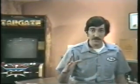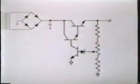There are some high-voltage power supplies in games that also have to be regulated. For instance, the Bally/Stern pinball machines have score displays that require about 190 volts to operate, and that 190 volts has to be regulated — it can't fluctuate very much. We can't use the 723 to regulate a high voltage, as the LM723 is strictly a low-voltage regulator IC. When we want to regulate a high-voltage power supply, we have to make the supply out of discrete individual transistors, resistors, and diodes. This circuit is typical of those found in pinball machines and monitor power supplies — a standard series-pass regulator circuit with a regulator transistor and a driver transistor in a Darlington setup, but instead of using an integrated circuit, we use a transistor and a Zener diode.